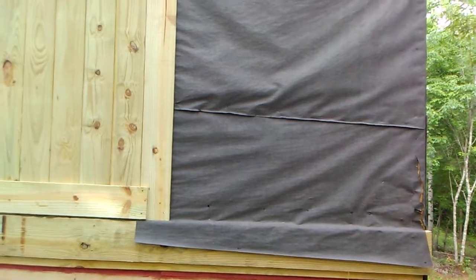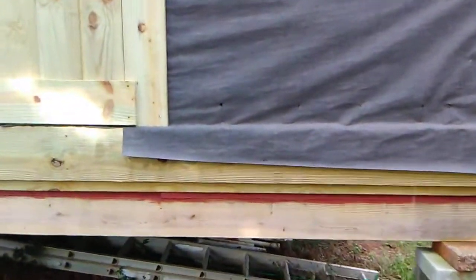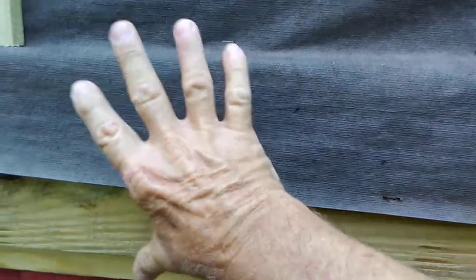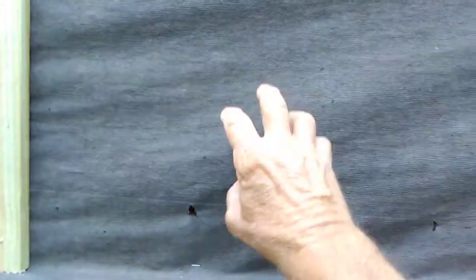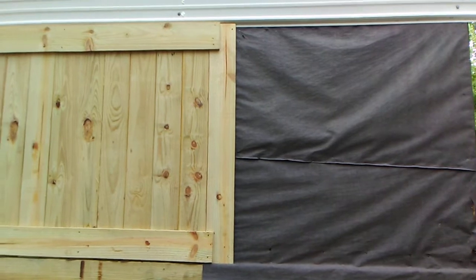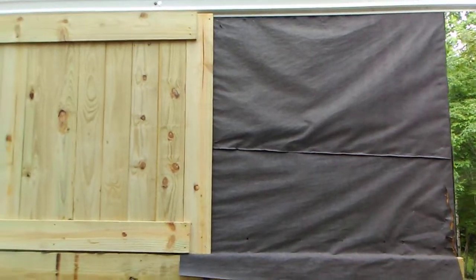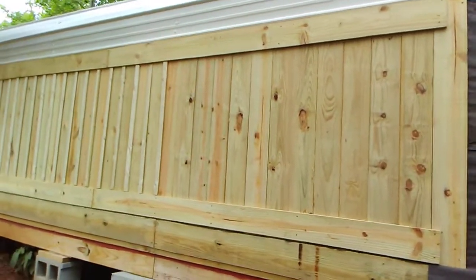It's a five foot tall building on the legs — the five foot legs on the carport. When I assembled it, it's sitting on a two by six plate, and then I used a two by eight here as a plate. That left me a four foot gap so that a four by eight sheet of OSB would fill it in. The eight foot dog-eared boards cut in half give you two strips out of every board, so you're looking at just a little over a dollar per board when you consider you're getting two out of each board.